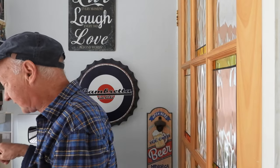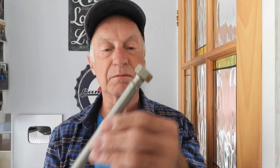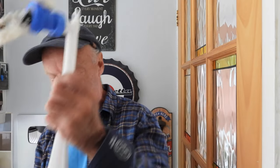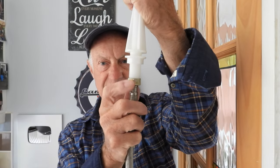The other type of connection going onto your valve is the old flexi hose. You can't do much with these — it has a new rubber washer on the end, which is a bit more difficult to get. If it's an old-looking flexi, it might be better to replace the flexi completely. You need a rubber washer and a fiber washer for the brass fitting. Once that's done it should be all good — the flexi screws up on there. Just be careful with plastic threads not to cross them; they're very easy to do.